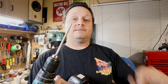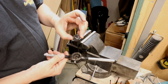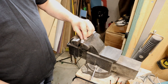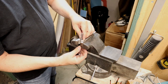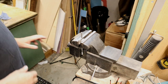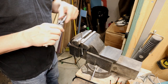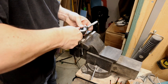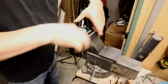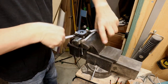Now let's use the die and cut this thread. The trick here is finding which is the start of it — it's a little bit tapered on one side and it typically tells you which way is down and which way is up. We'll screw that in, put some soft jaws in here with aluminum so it doesn't mark it up, and use some cutting fluid. The key here is to go as straight as possible down. This tool is really nice and super sharp — I guess that's why it costs $75. I'll go down probably about three quarters of an inch. That should do it.